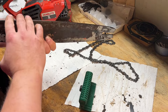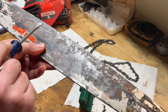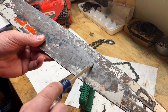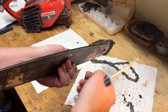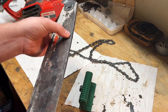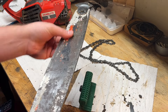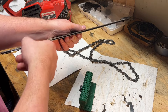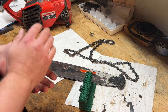I'm going to do that until it's good. Another thing is to make sure there are no burrs on the bar — you can see it kind of caught there. If there are burrs on the side of the bar that'll catch on the wood you're trying to cut, maybe the burr sticks out a little farther than the chisel, and that'll stop you from cutting as well. So I'll probably end up filing that off and then doing this hone. I'll bring you back when I'm ready to sharpen the chain.